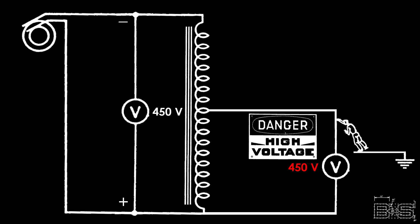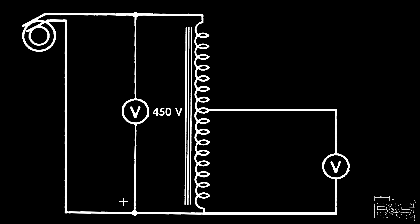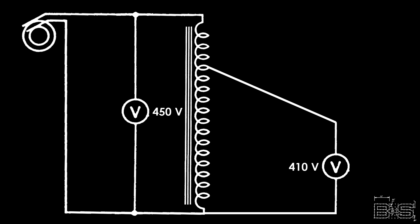One of the disadvantages of an autotransformer is fault current. If you have a fault in the wiring on the secondary side that shares the same neutral or ground as the primary side, you're going to get all that primary voltage on the secondary. Another disadvantage for step-down autotransformers is what happens if the common winding breaks — this is known as an open secondary. Without the magnetic resistance from the secondary, the flux has nowhere to go and is picked up again by the intact portion of the coil, creating a potentially hazardous situation that can damage equipment and personnel. Additionally, you can't get less than half of the voltage out of a step-down autotransformer, which limits voltage regulation.